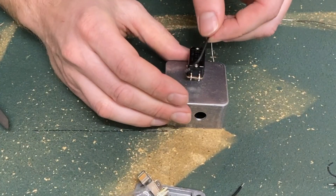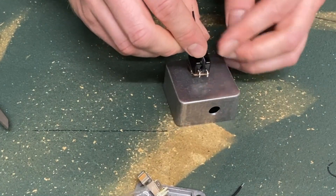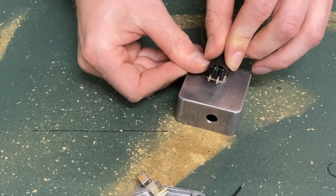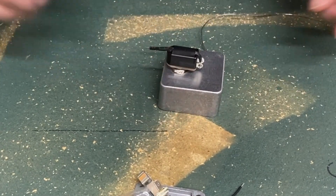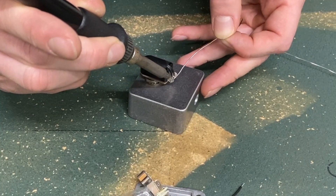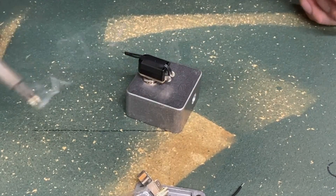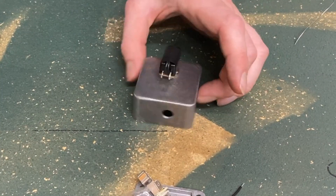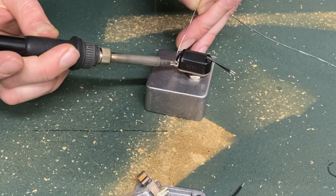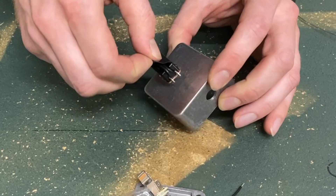Take your wires — you can do this one wire at a time if you'd prefer, but we're going to do them both together. Insert the stripped end of each wire into each lug. You don't need the tape, but it's very helpful to keep the wires in place. After your iron is nice and hot, clean the tip and tin it with some fresh solder. Wedge your iron firmly against the switch lug and wire, wait a few seconds for it to heat up, add solder until it flows, remove the solder, then remove the iron. Let it cool for a few seconds, then repeat the process for the other lug. Let the joints cool and solidify, then feel free to remove the tape if you used it.